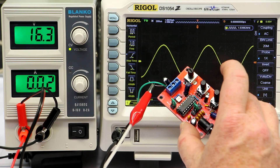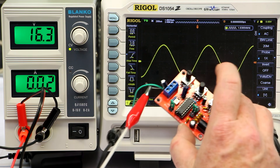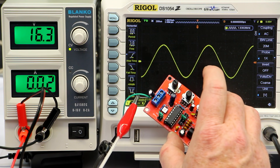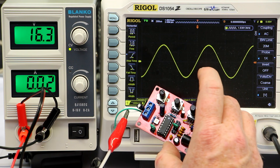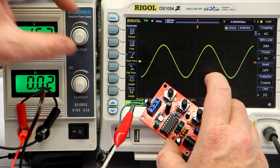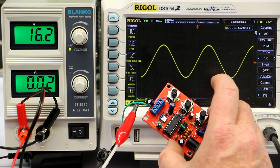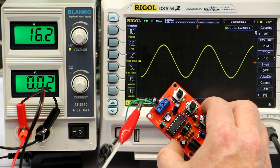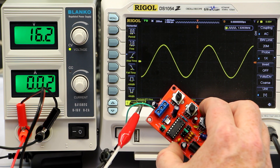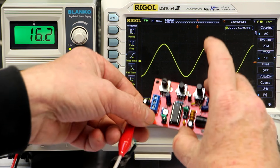The fake chips only work up to 12 volts or something below. For me that's okay because I want this to be battery operated at nine volts — portable and isolated from any mains power source. But it's quite interesting: you cannot use the original eBay chip for voltages even near 12 volts. These are probably counterfeit XR chips. Now let's go on to the other issues and how you can fix them by replacing some components.